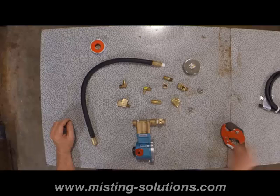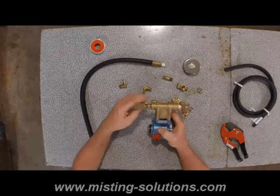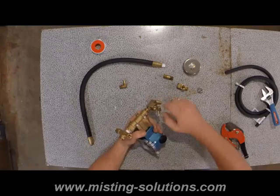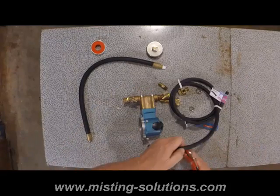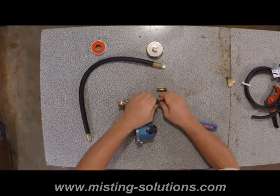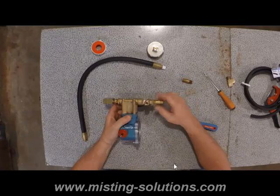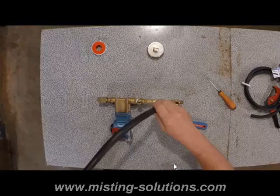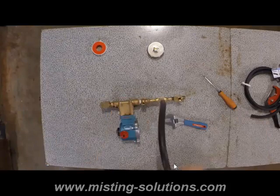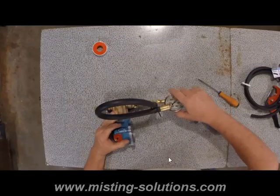We've got a hose over here that we're going to cut to make the bypass. You can see I'm showing you the hose. Now I'm putting on the first fitting and the second fitting, which is a reducer and a T, showing you that you tighten those up after you've got the Teflon tape on. Now I'm putting on another — this is the barb hose fitting for the bypass line. Measuring it out, cutting it off, putting on hose clamps and screwing them down. Now I'm putting the check valve on — you've got to make sure it goes in the right direction; there's an arrow on the check valve. Now we're putting on a T, then another brass nipple and another T. The first T is where I put the pulsation hose. I wrap the hose around and put a wire tie on it.